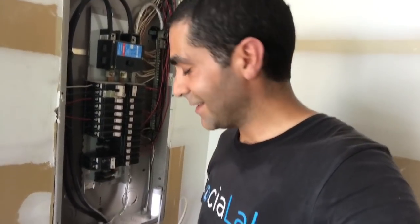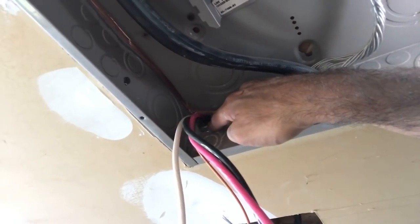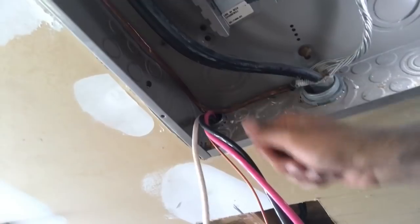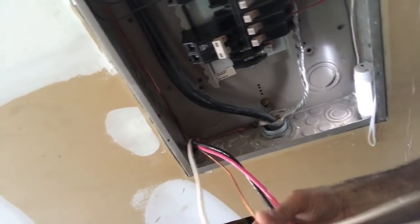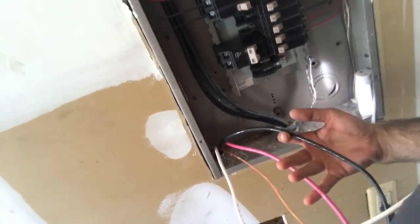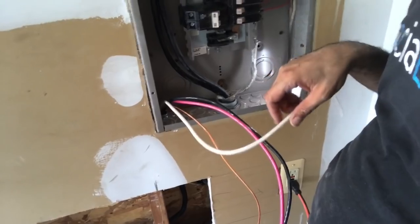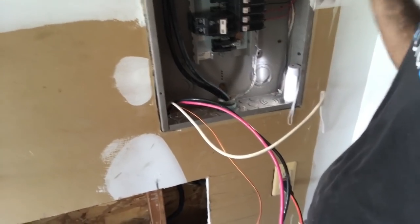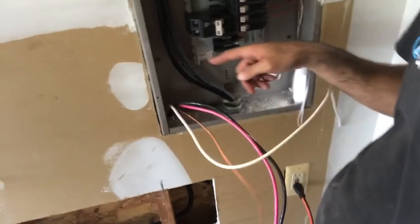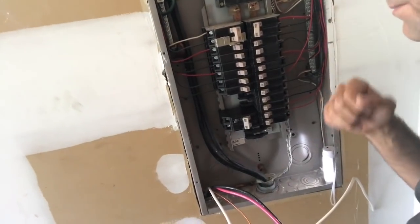I had to pause the video - that was kind of a pain to get the wire right through. Nevertheless we do have it through and I put a three-quarter inch snap-in Romex connector through from the bottom. We pulled the wire through, stripped back all the sheathing, and unstranded the wire. What we're going to do here is take the two hot leads - the black and the red - and put them into each pole of this breaker. The neutral is going to run along the bottom up to the neutral bus, and the ground is going to run up the left-hand side to the ground bus.